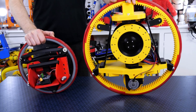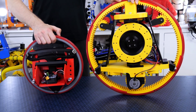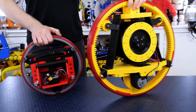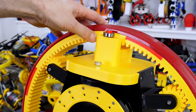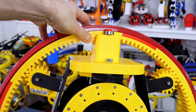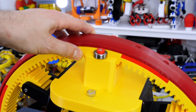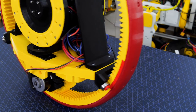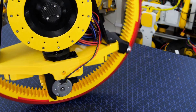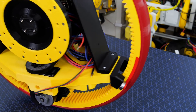This is quite a bit bigger than the last one I made — probably 180% of the size if we compare the height of them, so a much bigger machine. I've used bearings to align and constrain that track in the right place as well as some idlers like I did last time. A lot of people suggested herringbone gears but with the flexibility I was pretty sure those were going to pop out. There's another pair of bearings each side down at the bottom just to make sure that track all stays aligned and doesn't fall to pieces in motion.